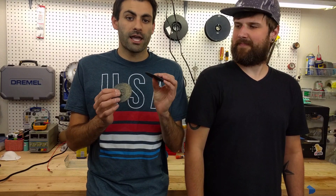In order to electroplate an object, it has to be conductive. However, our 3D prints are not conductive, so we're going to use a special kind of paint to make them conductive. To electroplate an object, you're going to need a power supply — we're going to use a 6-volt camping battery — and a source metal. In our case, it's going to be copper from a computer heat sink, connected to the positive terminal or anode. You'll also need the object you want to plate — our 3D printed medallions — connected to the negative terminal or cathode. Lastly, you need an electrolytic solution; we're going with copper acetate since we're coating with copper.